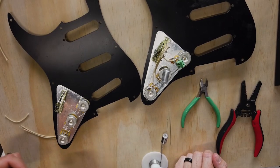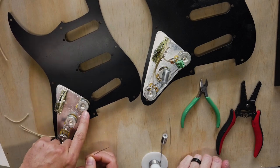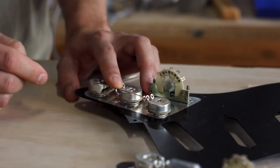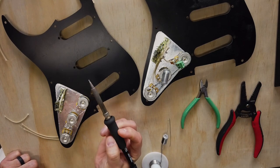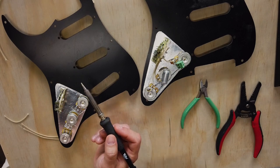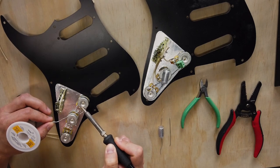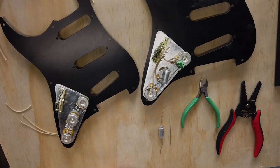So David, show me where to start wiring up this harness. Okay, so I'll start with all the grounding first. Use the bus wire here. Normally you can bend back the tab here on the volume pot — you want to ground one side of the volume pot. If it's a standard audio taper, you're going to do this side right here. I'm running the bus wire just through the eyelet and then connecting it to the back of the pot. When you're soldering, you want to make sure the tip is clean — wipe it on the sponge and then it's nice and shiny and ready to go. Then I'll set the iron down, touch both the back of the pot and the bus wire, get the heat going, and then flow the solder into it.